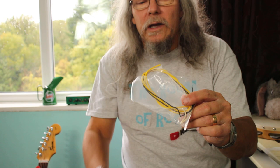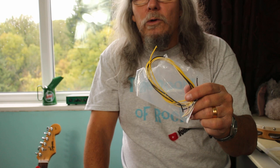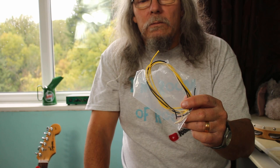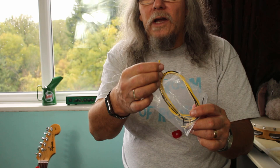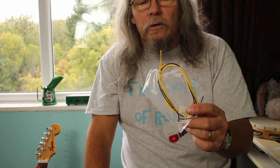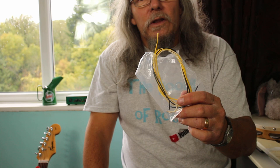You'll also want some wire. The wire I've got here is guitar wire bought off eBay with cloth insulation, so it's got a vintage vibe about it. But any wire you have can work — it doesn't have to be anything specific. You don't want it too flimsy; you want it reasonably beefy so it's easier to work with and less likely to have the insulation melt away as you apply heat when soldering. I think I paid a couple of quid for three colours. So those are the parts you need.